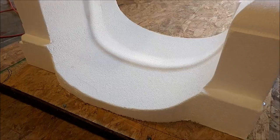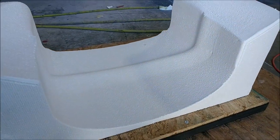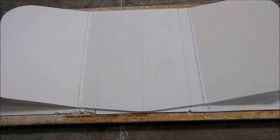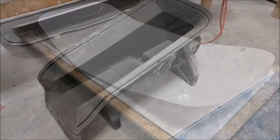Here's the finished product — it's all cleaned up and ready to have some fibreglass put on there, and ultimately to be sprayed with putty and back on the machine again. I mentioned there was another piece to that tank: this is the closeout, and it's basically the simplest thing we've done — just three flat surfaces. That'll be the lid for that tank.